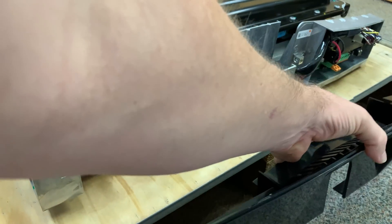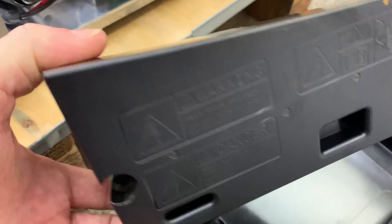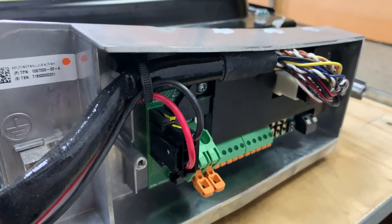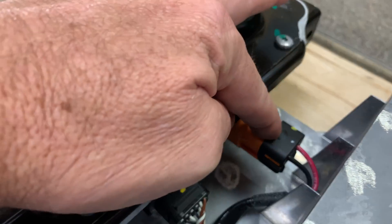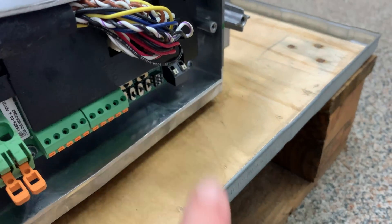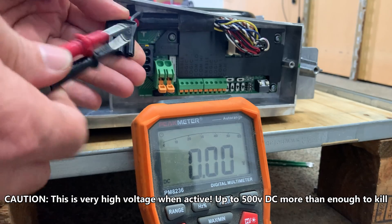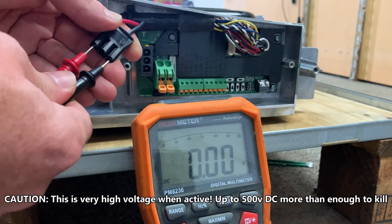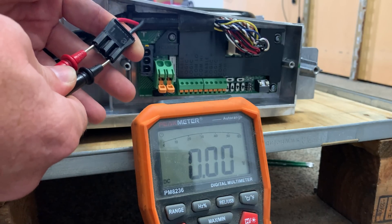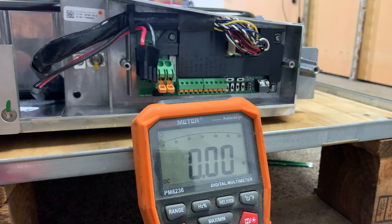The cover plate along the bottom was removed and was held on with two T30 screws. That small cover just covers the incoming DC and the data cables. In here we can see the DC coming in, the DC going into the battery, going around and back into that plug. I'll just give a quick check — unplug this and check whether we've got any voltage. I'm assuming there won't be. We've got nothing. I'd imagine there's a contactor controlled by these wires here inside that shuts the battery down until it's told to turn on.